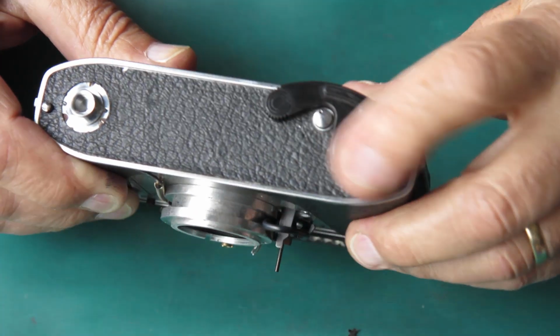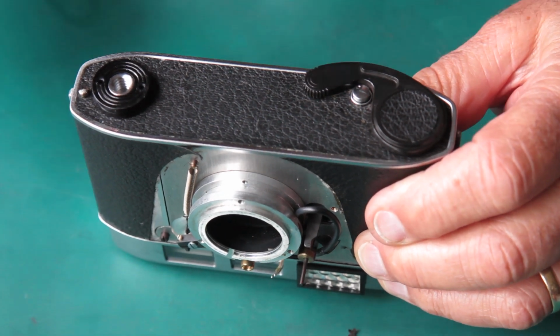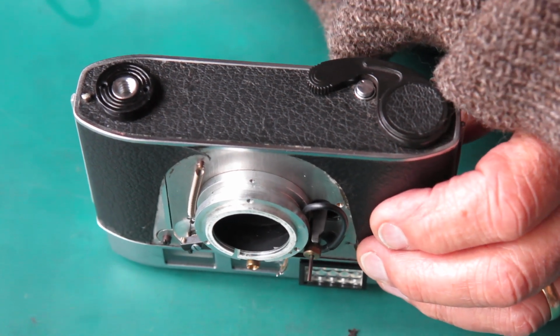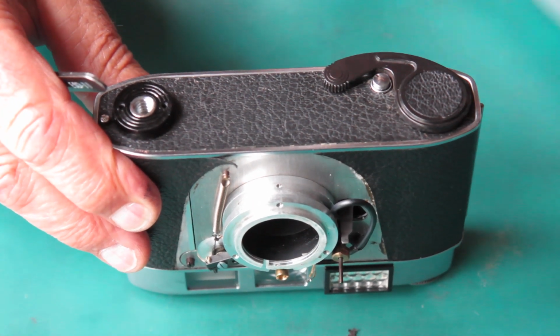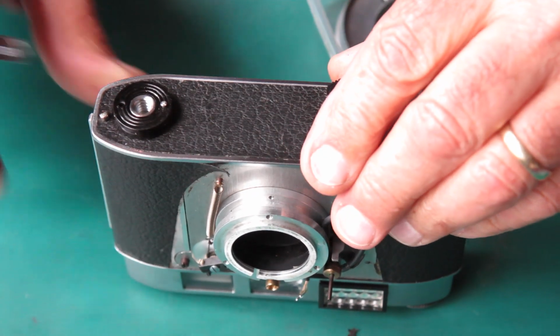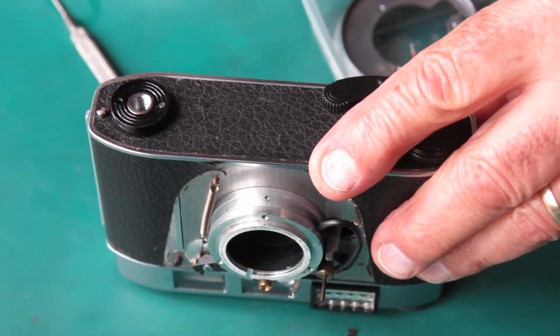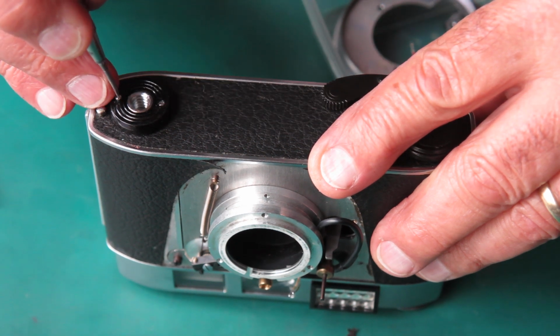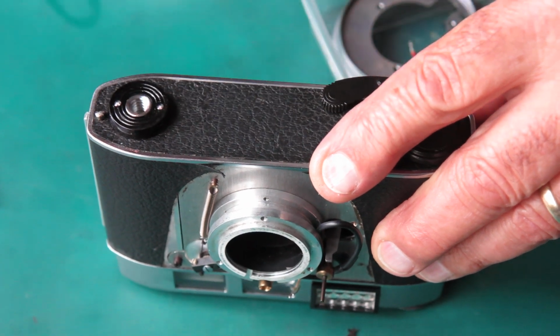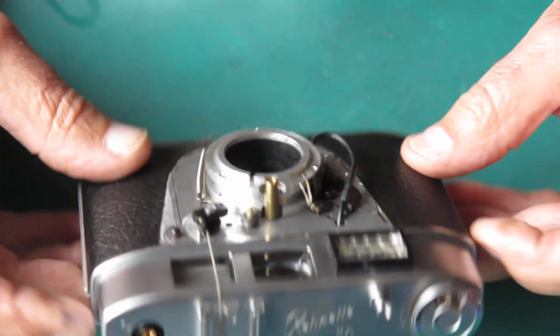Right, so the leatherette patch for that can go back in place, I think. That's our leatherette patch back on there, and with that I can put this back on, I think. As for the film advance lever, don't over tighten those screws. You're only going through plastic. You don't want any unfortunate incidents. Okay, so that's the base of the camera closed back up, and we can deal with the front